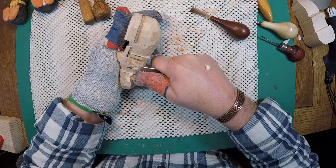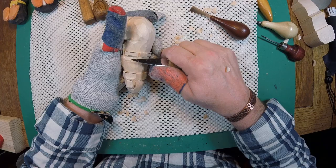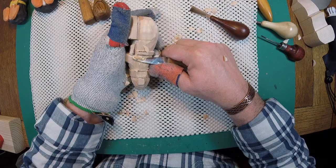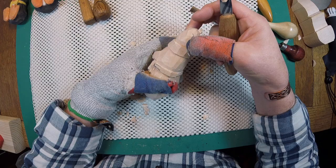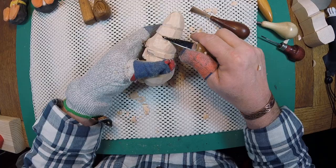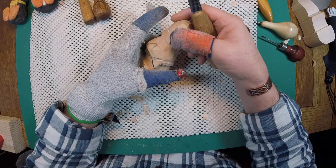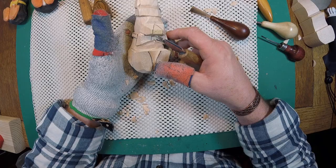It doesn't look very finished. Especially if you're going to do a competition, one of the things a judge wants to see is finished work. There's a difference between primitive and rough and finished. But if you're doing something like this for a customer, competition, or your own personal pride, get those saw marks and split marks off. It frustrates me when carvers at a high level leave things like that - it sets a bad example for those coming along behind them.